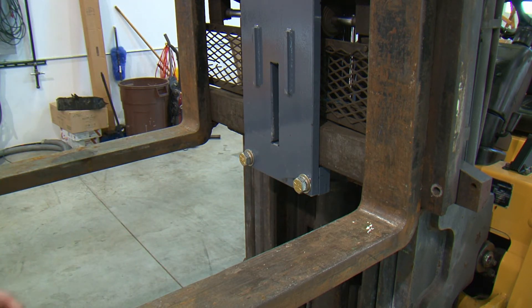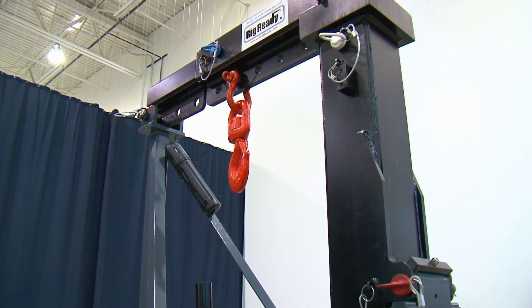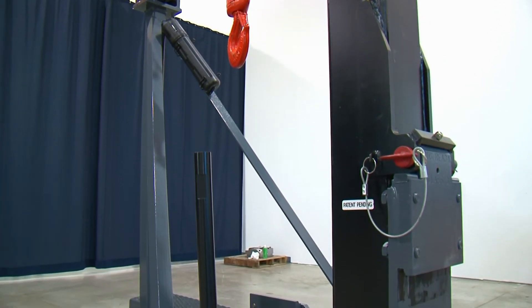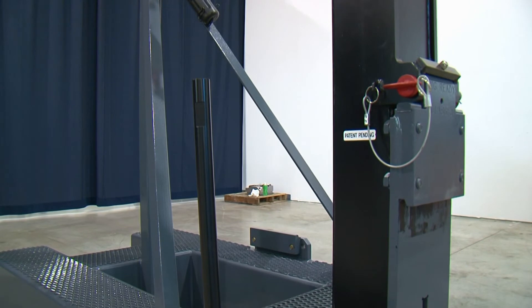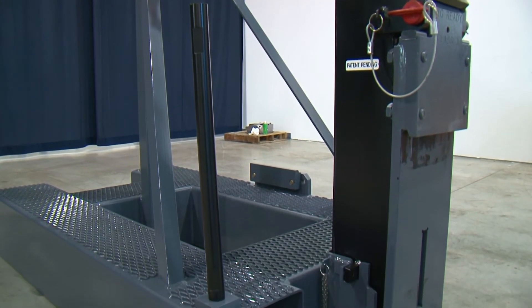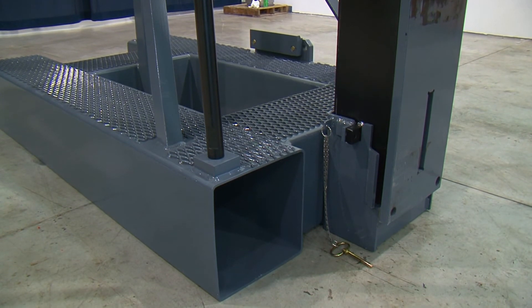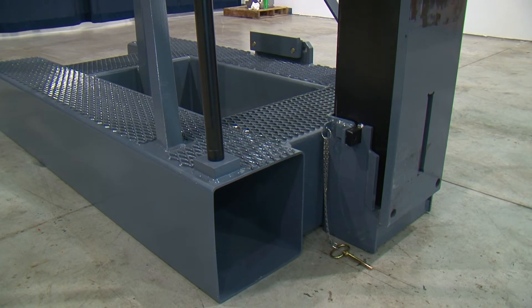Now the Rig Ready Boom is ready to attach the main plate to the boom and take the boom off the stand. At this point, you can either take off the forks or connect the boom onto the main plate that is mounted to the carriage with the forks on. The tubes in the stand are designed large enough to allow hookup and disconnect of the boom with the forks still attached to the fork truck.